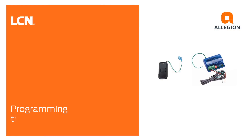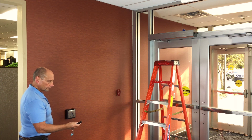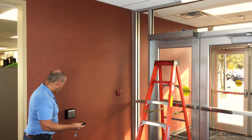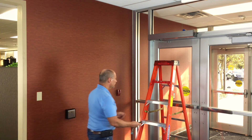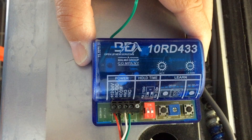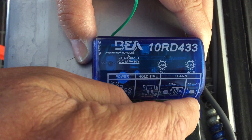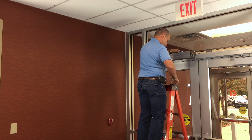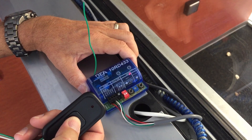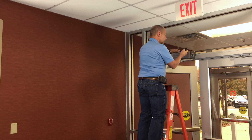Next, program the transmitter. When the transmitter will be connected to a wall-mounted actuator or bollard post, program the transmitter first to ensure wireless operation is functioning, and then connect it to your actuator. In most cases, you will want the door to open immediately upon activating the transmitter. Therefore, press the NO DELAY button on the receiver until the red light appears, then release. Then, press the button on the transmitter twice, slowly. A blue light will flash on the receiver to indicate the signal from the transmitter has been received, and the operator will open the door.